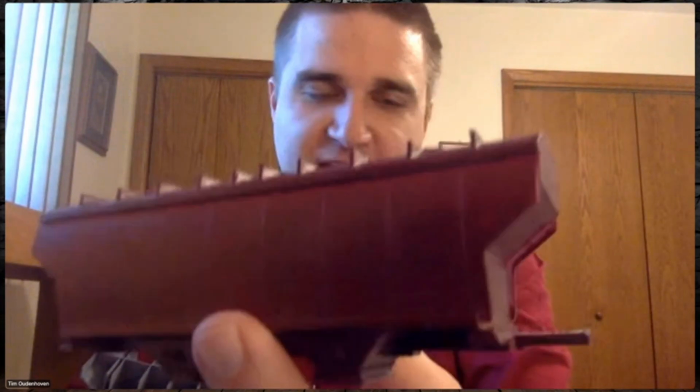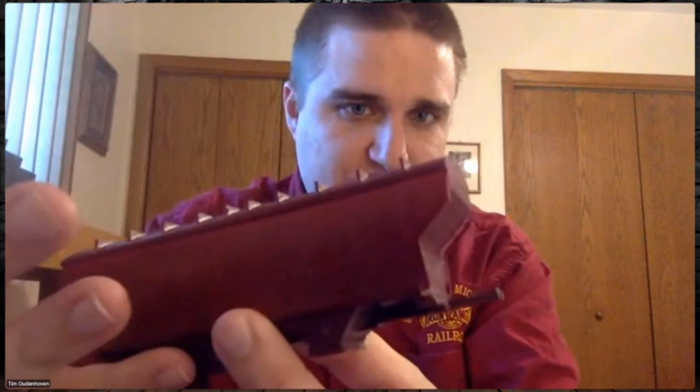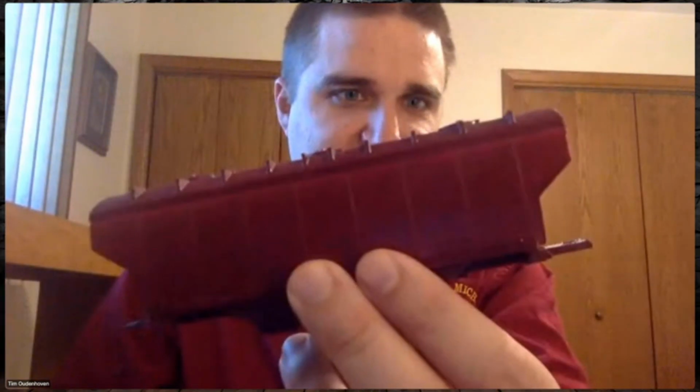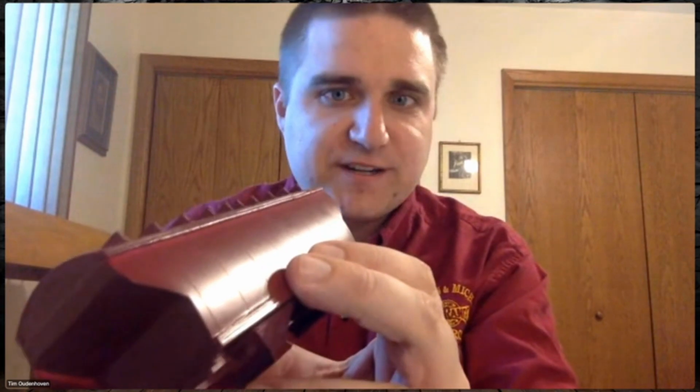And I don't see the problem with 3D printing, it's really 2.5D. And so you're going to get ridging with FDM if you try to print this curve. And then trying to do the ribs and stuff, you get vibration, all kinds of artifacts. Where this is quick and easy. It takes 20 seconds to cut it, and it makes for a really, really nice car. And then I can 3D print all the rails and ends, the top, all the parts that are more complex. But anytime I can use the Cricut Cutter, I do.